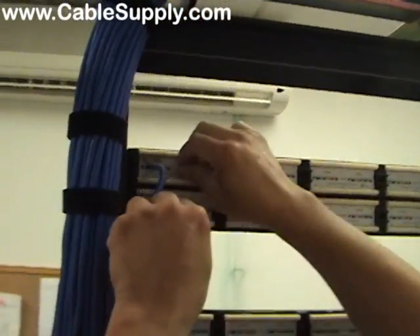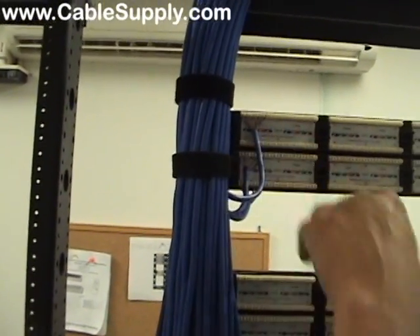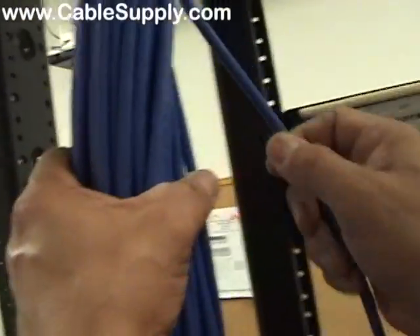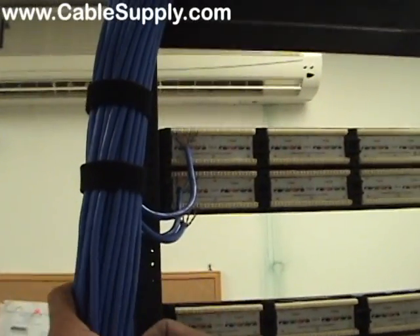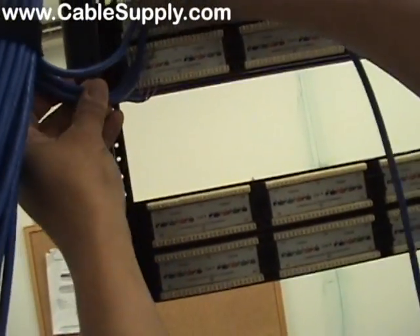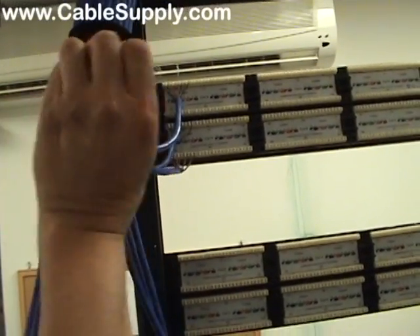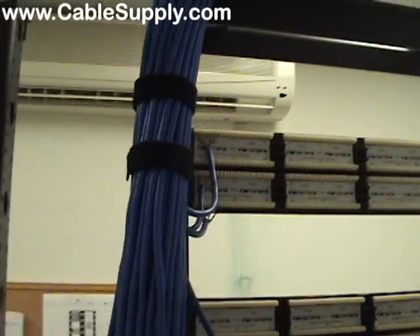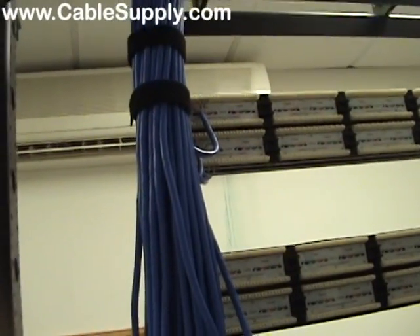Patrick, how do you know which cables to punch down? Two ways: you can pre-number them or just pull them from the stack as they fall. You want to avoid grabbing a cable that crosses everything. From the back, take the next cable and bring it in close. It's not necessary to label each cable coming in because once everything is punched down you can identify it from the jack — when you test it, it will identify which port goes to which cable.